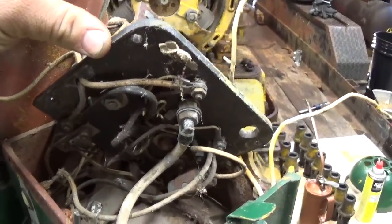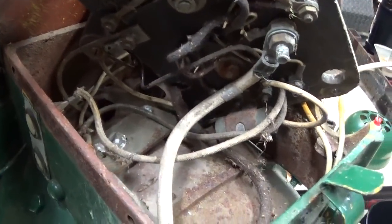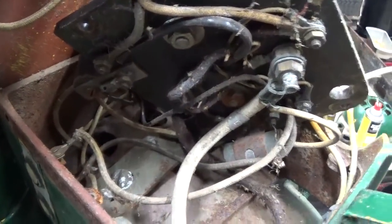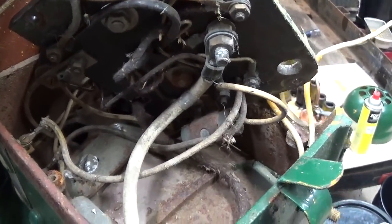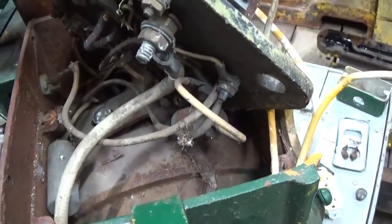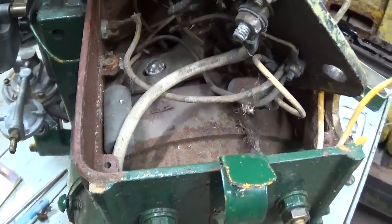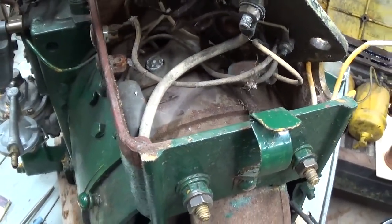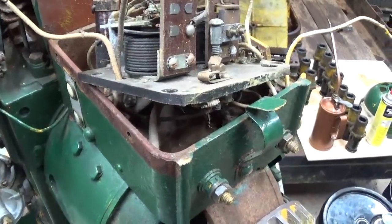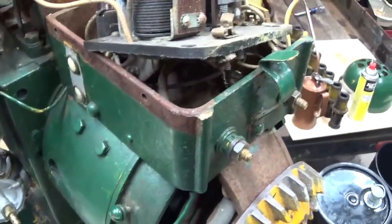Dirty, but looks pretty serviceable. I haven't seen any nicked wires or anything that looks like it was a hot connection. A couple condensers under there. We're going to have to determine what their function is to see if we can eliminate them out of the circuit. If you remember the last video, the last Onan generator, I disconnected all the unnecessary electrolytic capacitors that were in there,